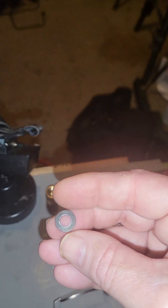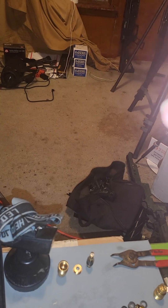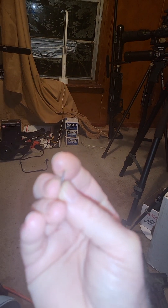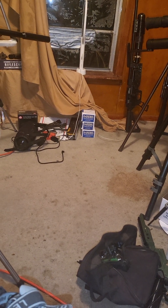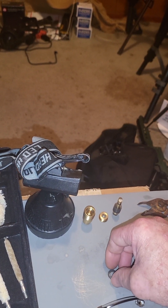See how much it did? It started doing just that little bit. You're looking to take that little edge off, because when these bevel washers — which are cupped the same way my hand is — this little edge surface, you want flat, because this one is curved to the right. You want that curve to match flat and mate around the edge to seal it. It's just going to make things better.